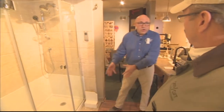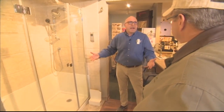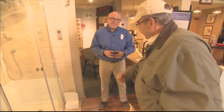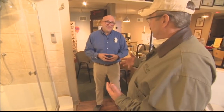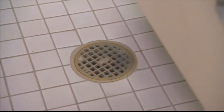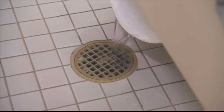Well, definitely. You have to worry about where the water goes, of course, and then if that ever evaporated, you have the sewer gases coming back up into the property, and that can create a whole other issue out there. And earlier in the show, I think it was Jim who was saying, when you fill that back up, make sure you have personal protection equipment on, because you could splash some of that and get it airborne. So probably a good idea to go around all the floor drains initially and make sure those are all carefully filled?